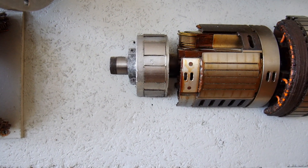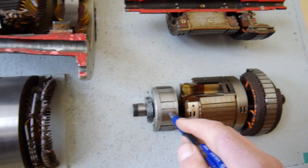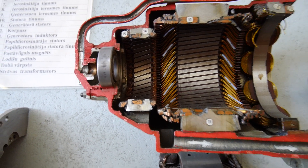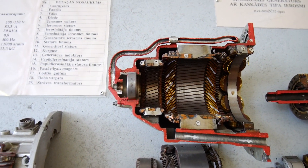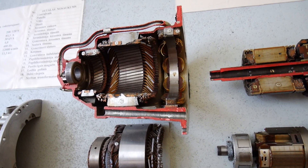The power to the voltage regulator is supplied by means of the permanent magnet generator. These are permanent magnets, and these permanent magnets are rotating inside in this part — this is the pilot exciter. This is the armature winding of the pilot exciter, also called the PMG. As you can see, there is nothing new compared to the previous generator which was discussed during the previous video with air cooling.